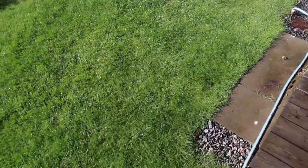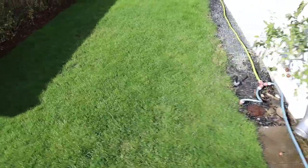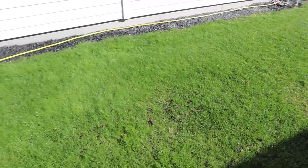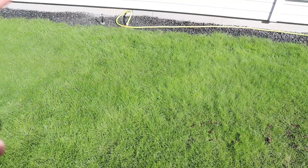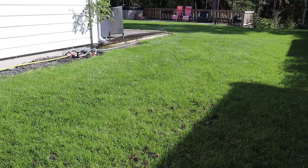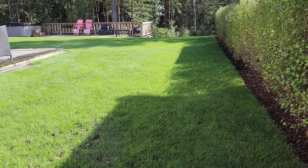This one can actually reach just about over here so it's just about head-to-head coverage. The other one though isn't actually reaching all the way over to that other head, so it doesn't have head-to-head coverage. I think I'll need to replace this one with an MP 2000. All that's left is to take my cups and do some measuring to make sure I'm covering all the area without any dry spots — let's put these out in different spots.